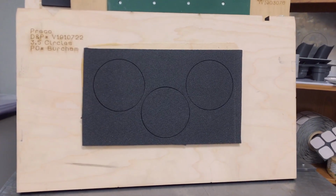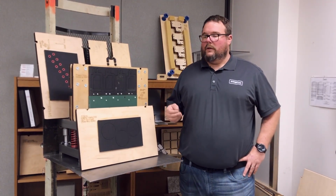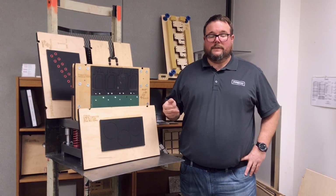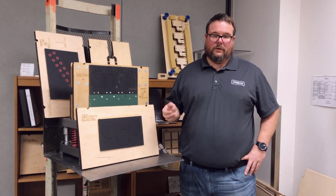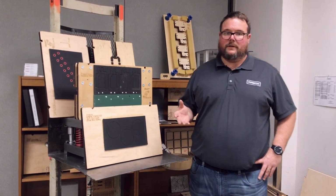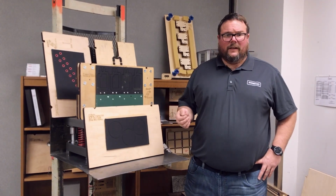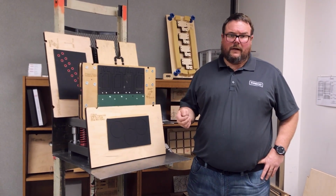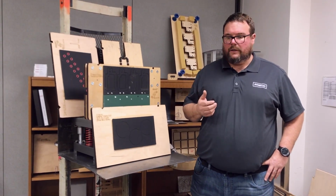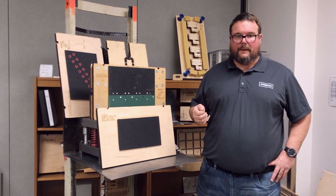You can use 937 rule, 1¼ inch, 1/8 high rule. There's razor rules, different thicknesses of rule. You also have the option, you can do perfing rule, you can do creasing rule, you can do serrated rule for hard materials, things that are difficult to cut. Again, the dies are fairly inexpensive, anywhere from a few $100 up to $1,000 for a more expensive tool like a bolster tool. They really are good dies. A lot of people use them.